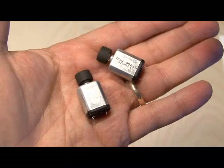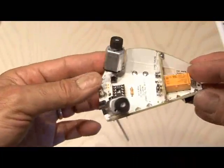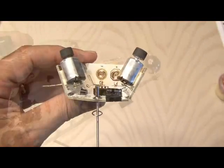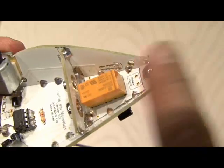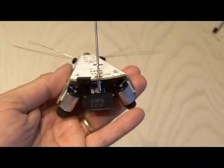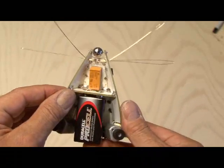After putting the rubber wheels on the two motors, those need to be soldered in place. Pay attention to polarity, and the instructions will be clear how these are installed. Now every good mouse has a nose, and Herbie's is made out of this hard metal bead. It should spin freely. Okay, our last step is to form and install Herbie's whiskers, which also serve as backup sensors.